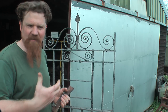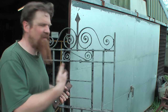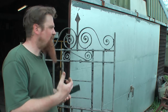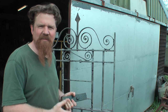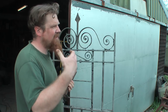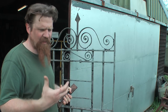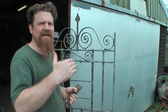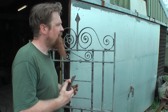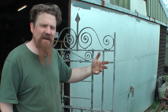And you could do that with what this is, or this, the steel that I buy for making gates and things like that, is hot rolled steel, and it comes out with a black oxide on it, and hence the name blacksmithing. All that stuff then is, like I say, just metric equivalents of the old imperial, but because it's always sold as only a nominal size, it's fine to do that. It's always plus or minus 1 or 2 millimeters, and that's why you get strange progressions in the sizes available.